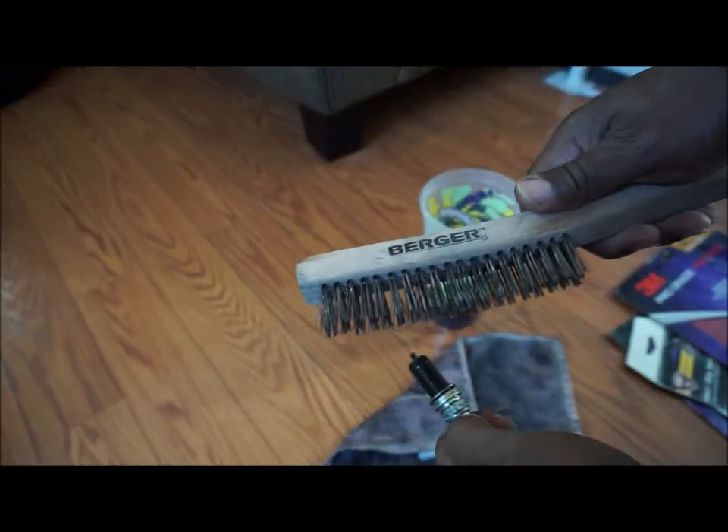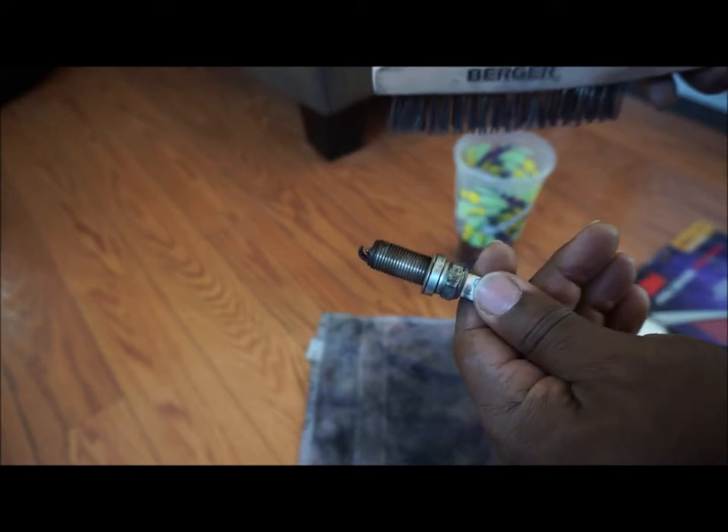You can get this brush — two of them for about $4 at Harbor Freight Tools in the welding section, used to scrape off welded pieces. I'm just going at it like so. I've already exposed some of the threads. I'm not putting a lot of heavy force on the threads — maybe 30 to 40 percent of force, just going back and forth to clear it off.